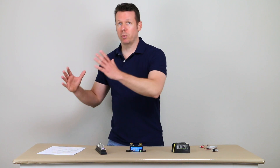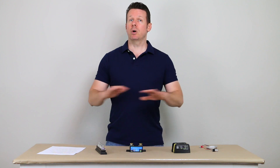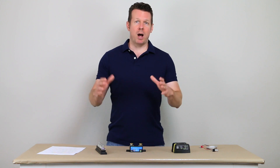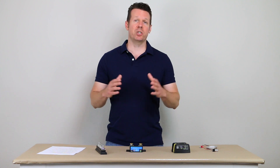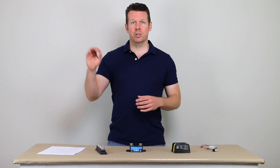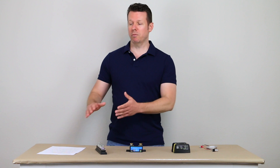What I recommend is going with 12-volt appliances, because they run directly off the batteries with no conversion — no converter or inverter needed to raise or lower voltage. Get everything you possibly can running on 12 volts straight off the batteries. That's going to make your system as efficient as possible, reduce the number of batteries you need, reduce wear and tear on your inverter, and when you go to bed at night, you can just turn the inverter off to extend its lifespan and save battery power.